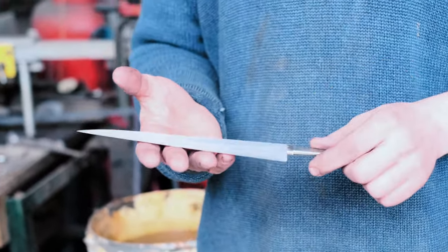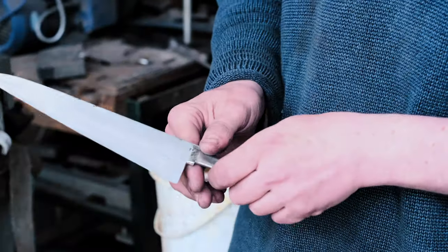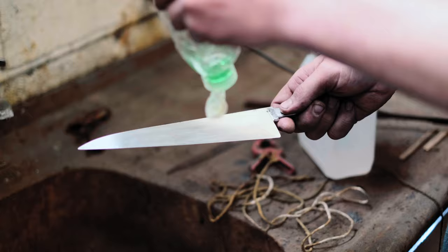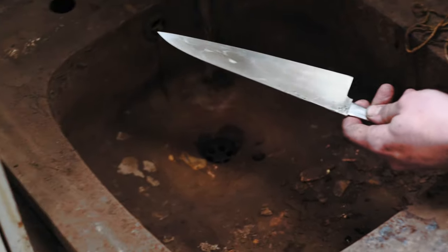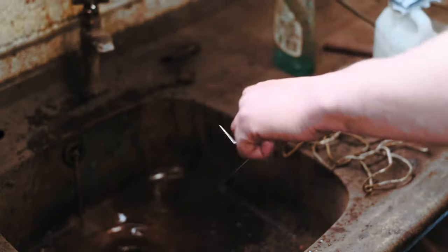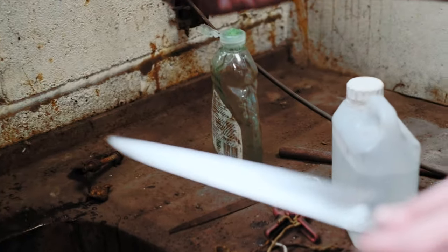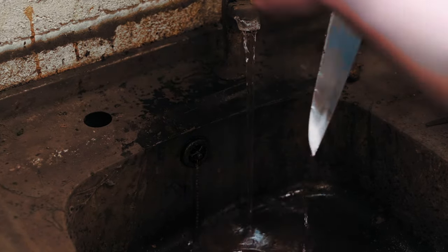The last step before starting to fit the handle will be to clean this off with some solvent and very quickly dip it in the acid to bring out the contrast between the core and the cladding. When I clean a knife for etching, I like to start with a little bit of dish soap — one drip per side — coat the whole thing, then rinse it off. Then isopropyl alcohol, or acetone if you like, something that cleans quite clean. Then rinse it under clean water again to get any little bits of lint or dust from the cloth off. And that's now ready to etch.